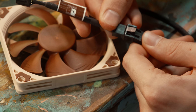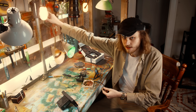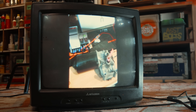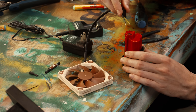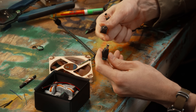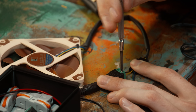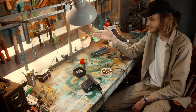Maybe I can use this other little adapter that came with it to make a plug. I'm gonna guess black is negative and yellow is positive. I got this fan for free from my buddy Lai — he needed a DC motor to fix his film developer, and I gave him the torquey windshield wiper motor out of my Hyundai. Let's test it with a 12 volt battery. It's spinning — I think I was right about the pins. I have this box of random connectors Lai also gave me, and these are actually the same connector, so I don't even have to wire anything to the wall plug. I can just screw those two wires straight into it and we should be golden.